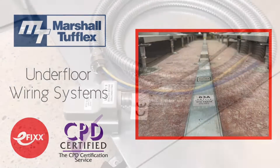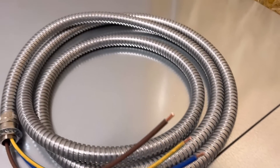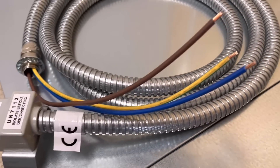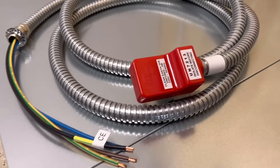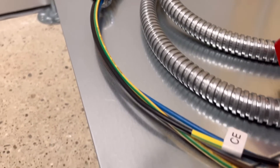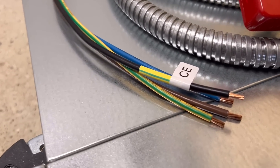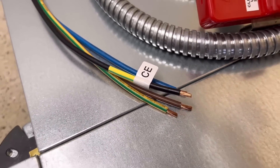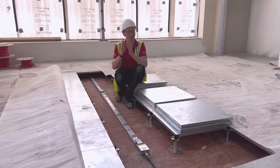These tap-off units have sturdy metal flexible conduits on them in three or five metre lengths, and inside them there's the line, neutral and earth conductors. If you look at a clean earth version, you can see there's a fourth black conductor in here, and that conductor has a bit of green and yellow sleeving with a clear label stating that this is a clean earth. That's a really neat solution to make it clear which earth conductor is which, while still complying with the requirements for identification in BS 7671.